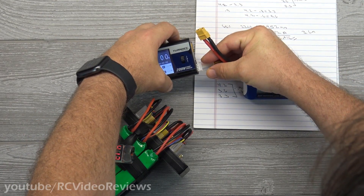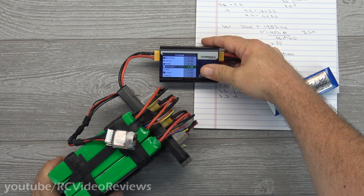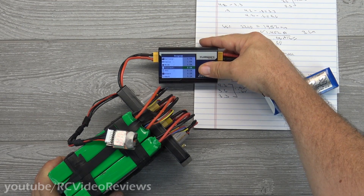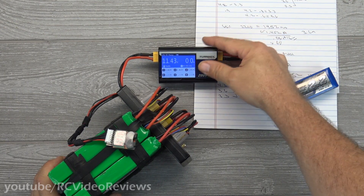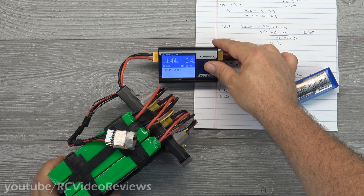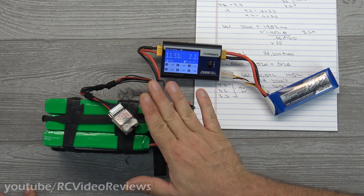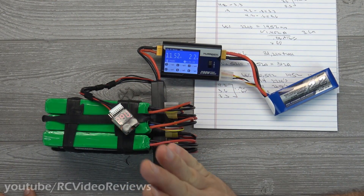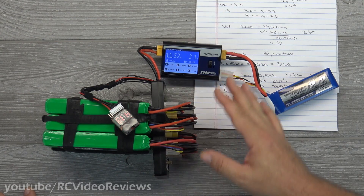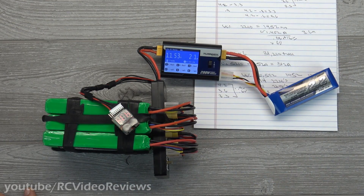Here we go — you just plug in a battery and you can see I'll set it to 2.2 amps rather than 3, and there we go: 12.2 volts in at a 2.2 amp charge rate. You can take a system like this and not only parallel charge but also parallel discharge. I'd encourage you to use the balance leads, keep the amp rate kind of low, don't punish the pack, use a balance board — and you can certainly use this as a power source at the field.